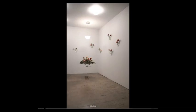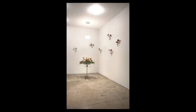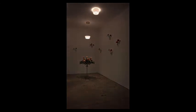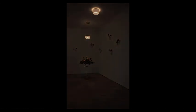So what's happening now is we're beginning to turn the downlight back on. And if you look at the floral arrangement again, that shadow is becoming more crisp as the downlight ramps up. So now what you're seeing is the full intensity combination of both the downlight and the waveguide working together within the space. And now we're just going to bring it all the way down using our warm dim technology. So you're going to see the CCT, the color of the LED, actually change and become more warm, like a traditional halogen lamp would have done, and then it fades to off.